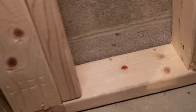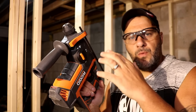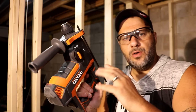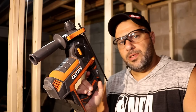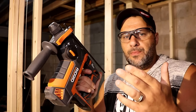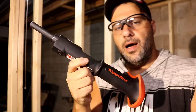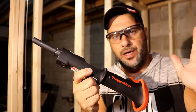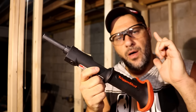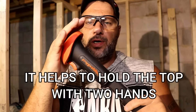If you're a DIYer on a limited budget who wants to do it yourself without spending a hundred or two hundred dollars on a specialized tool plus drill bits and fasteners, I think the ram set is the way to go. If you're a professional who already has rotary hammers and impact drills, tap cons are fine. But for fastening 2x4s to concrete on a budget, the ram set is the way to go. However, be aware: this thing is loud — sounds like a .22 going off — so you definitely need hearing protection. It also has some recoil; even with the rubber top, when you pull the trigger you'll feel it in your palm. I'd suggest wearing gloves as well.